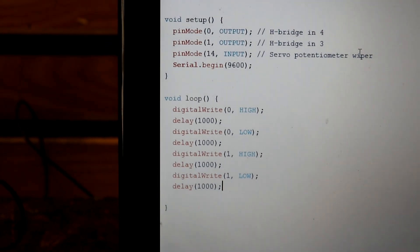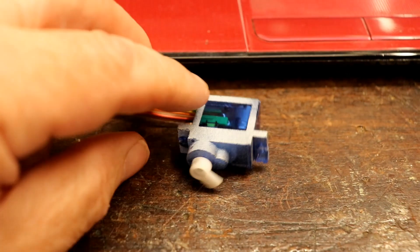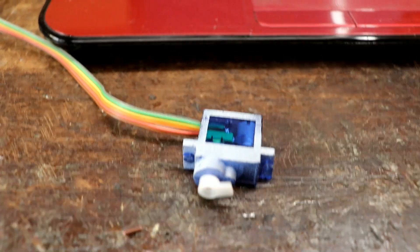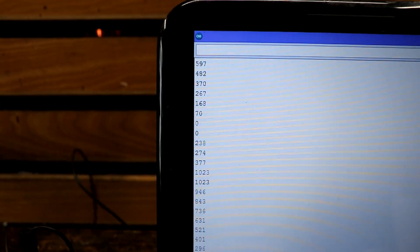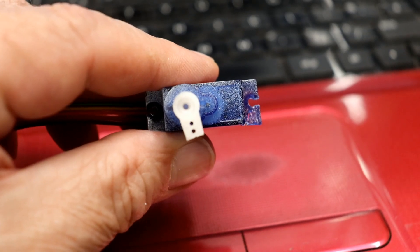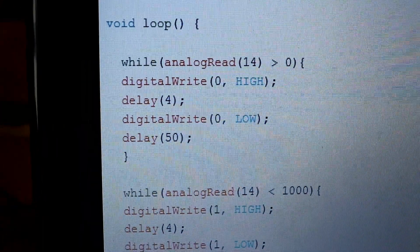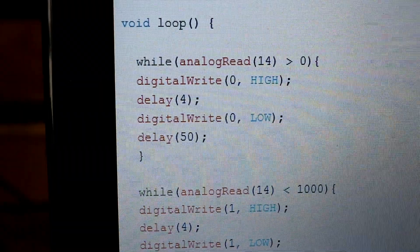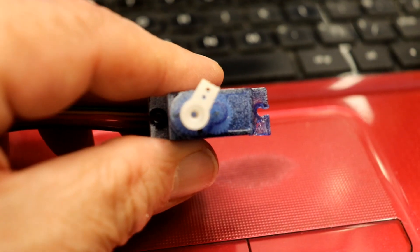Here's a nice simple little sketch. The switch is on the H-bridge control on one and the other — look and listen, that's amazing. It's just turning round and round. I've got that on analog write at 100, which is about half. There's the output from the potentiometer. Now I need to write a sketch to control it — find out where it is and tell it where I want it to go. I've worked out which way round it's going. The way to control the speed is not pulse width modulation, because that makes it too slow or too weak. If I switch the motor on for four milliseconds then off for 50, it seems to retain its power and go really nice and slowly.